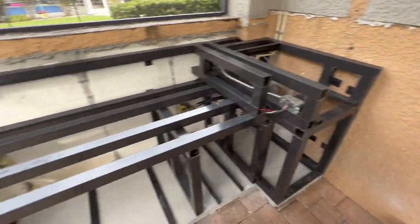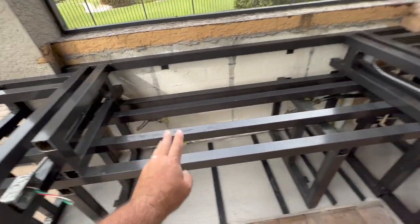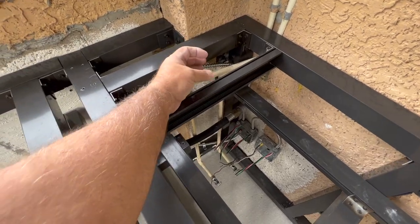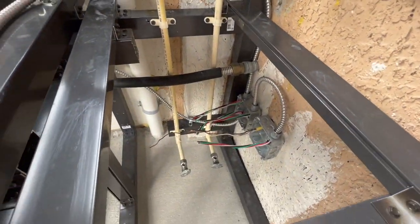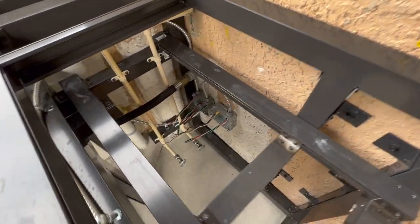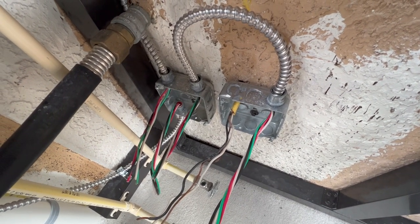As far as this framing — I built the recess for the grill and the recess for the sink. I had to go with a half-inch or one-inch beam here because I need enough room to get the faucet down between the water supply and the brace. I finished the water supply and haven't done anything with the drain yet — I'm going to wait until everything's in place before I cut it to get it at the right height. The yellow wire is the main electrical coming in.